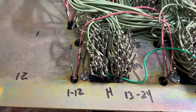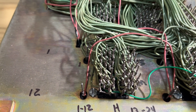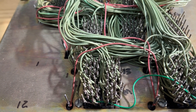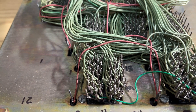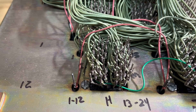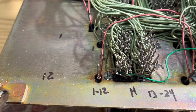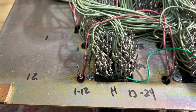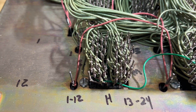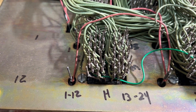This is a painful task that I do not recommend people try. I took the wires off, taped them, and did it in such a way that when I put them back on I had an idea of what layer they were in, so it looked like the wiring hadn't been disturbed. I wrote on here a whole bunch of things such as terminals 1 to 12 — they're actually reversed on the relay, but when working on this mentally I did it top-down only for marking the wires. In reality, the spring configurations are different.